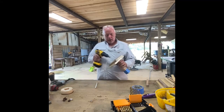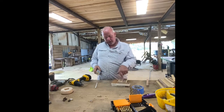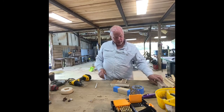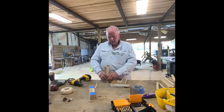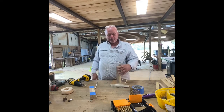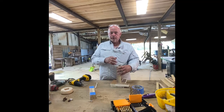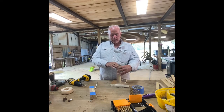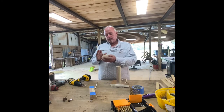That's the jig. Take the screw out, take it out of the jig. I'll rough that out with a band saw and when I get it on the lathe I'll cut it again. Press the pieces down in there and you've got them captured. Now, if you have a chuck, we're going to show you in a minute. If you don't have a chuck, just make another one of these, put it on the other end, and put it between centers to turn. I've made a version with a spigot on the end that goes in my chuck.